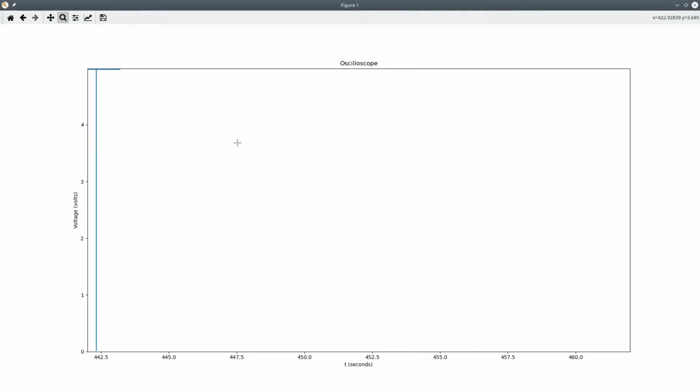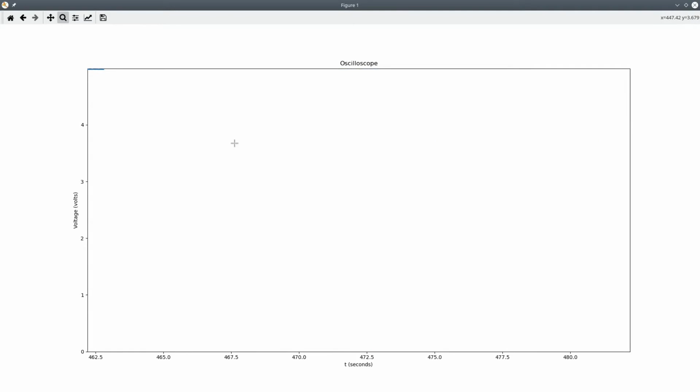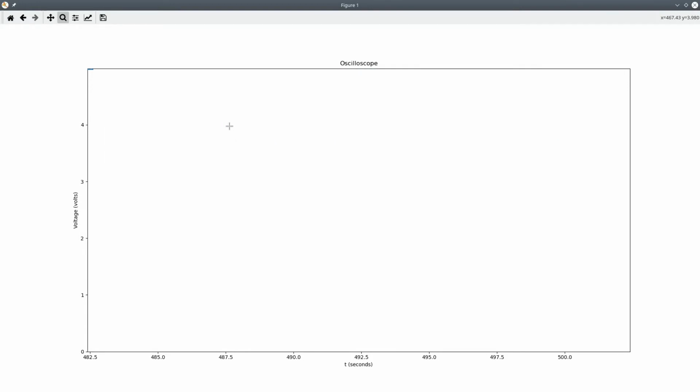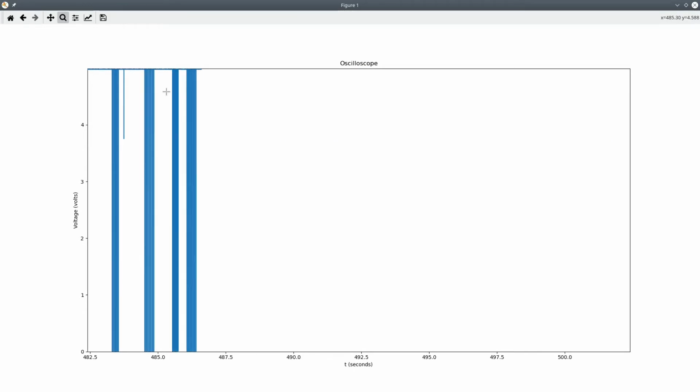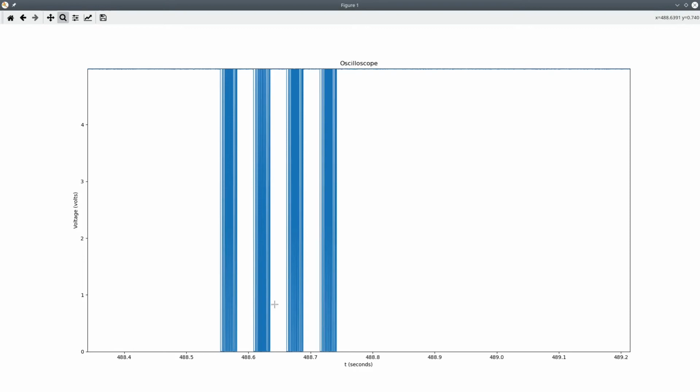I wonder why they send it 5 times. Seems like the receiver end has to not allow any more commands for however long it takes to do 5. And so in order to get this error resilience, they end up doing that. It's kind of fun to see something so functional, so easy. Give it 5 volts, give it ground, and it gives perfect, beautiful signal.